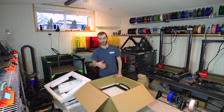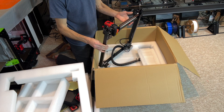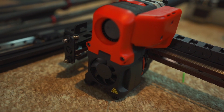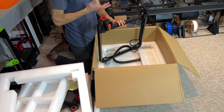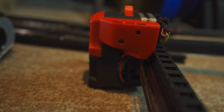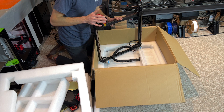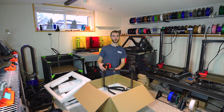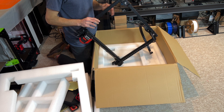That's a really nice touch by Vividino with this pre-assembled XY gantry. The tool head appears to be the Afterburner tool head — it's not the newer Stealthburner, so it's technically one iteration behind the state of the art, but the Afterburner is still a pretty decent tool head. In terms of the hot end, I believe it's just a V6 clone. We also have an inductive probe here for leveling. I'm seeing that these are genuine Gates belts, which is nice, and the motors are Moon's motors.